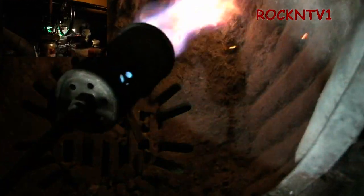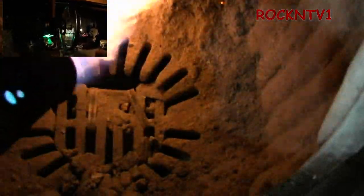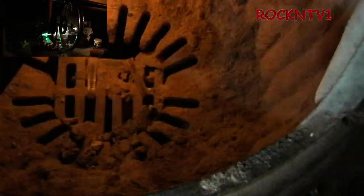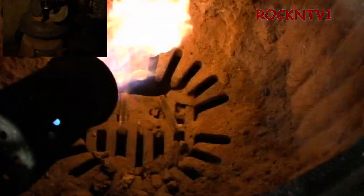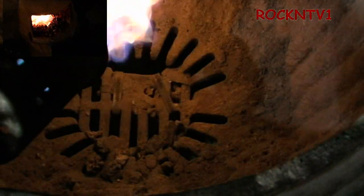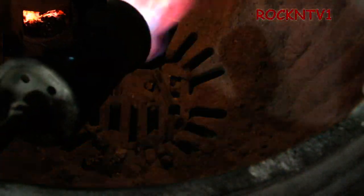Some guys talk about putting fire brick in, but this thing is like half-inch thick cast iron. If you burn green wood you don't need that. The whole point is the coal can beat the cast iron. I've got what's left of the ashes — that bottom ring is a solid bottom ring with the shaker in the middle. My stove pipe damper is open and that heat is going up the pipe, giving a little draw.